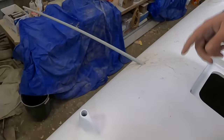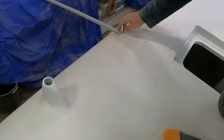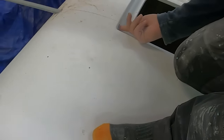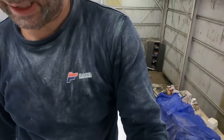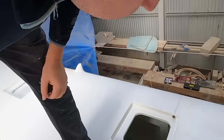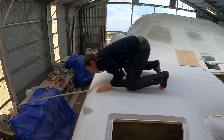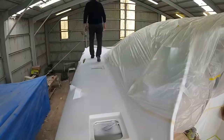This is an extended version of the drain — obviously I'll cut this pipe and glue it in place, then fare this out and glue here on the inside as well. This is going to be great — this is the way I wanted it, with the flush hatches and the clean decks, but a lot more work than is necessary. Now that I've managed to get all these holes in the boat, I'll have to fill them with some filler, then pipe, and make these drains actually drain. This is going to be the last project I have time for before I have to leave the country for a while, so my plan is to get all these pipes glued in today.